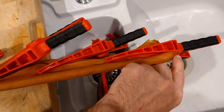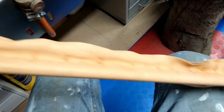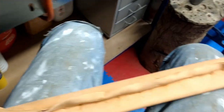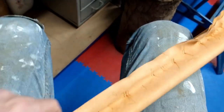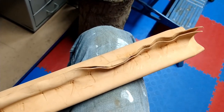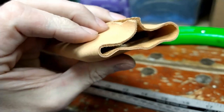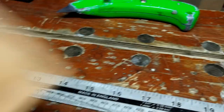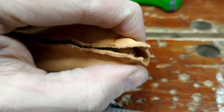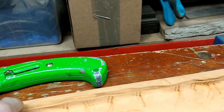I've got it as tight as I can for now - I've clamped it and that's it for now. Now I'm going to take a sharp knife and trim fairly close to here all the way along the spine, which hopefully I've tried to make as central as possible - this should start to be the foundation of the seam at the back. I've trimmed it pretty close now - about five millimeters left - still left plenty spare at this end. What I'm going to do now is mark along this edge, mark a fairly straight line all the way down, and cut that off flush with the edge completely.